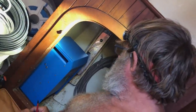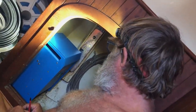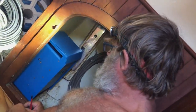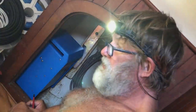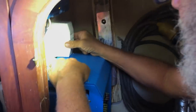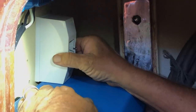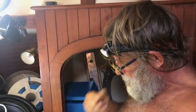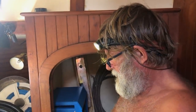Yeah, that's the inverter's in. That weighs 40 kilos. Anyway, it's in. So let's just get that wired, put in an RCD, run up through to the board, all good. What's that bit? It's an RCD, a residual current device. It switches, drops the power out if there's a problem. Let's say it's the easiest way of saying it.